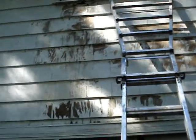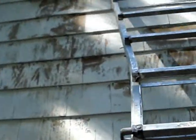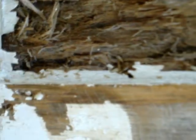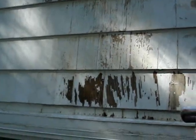This board up here, a lot of the paint was coming off around here too. I'm going to go up and show you this board directly because it is really terrible. I'm sure you already know about this one because there's aluminum flashing nailed to the side of the house here. But that is bad news bears. That really has to go. I'll fill it in with wood putty and oil prime over it. Got some paint just falling off the side of the house all over the place. But I'll scrape that off and oil prime and paint.